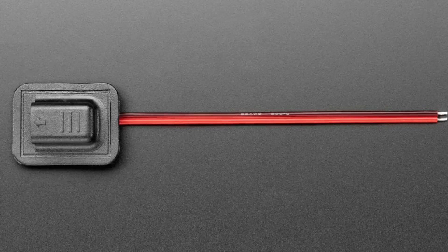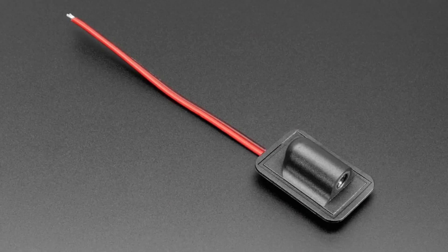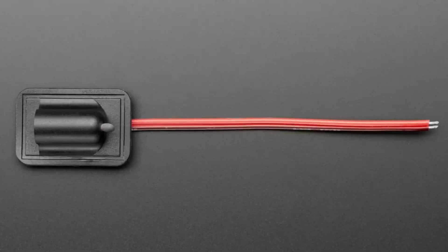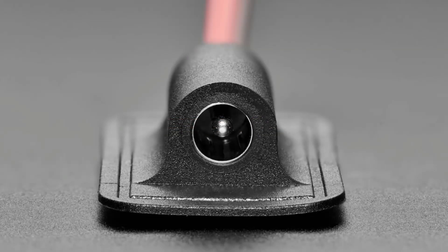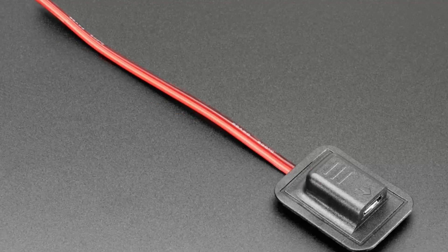I'm really going to go back to the factory and tell them to please put 5.1k resistors on there. If you do want to use it — which I don't super recommend — either use it to provide power, or make sure you're using it with a charger that is not picky about the CC lines. Just make sure you test it, plug it into your USB power supply and confirm it's providing 5 volts. And finally, we have a version with micro USB, which I would recommend if you want to do USB, because people are still using micro USB and you don't have that CC line issue.